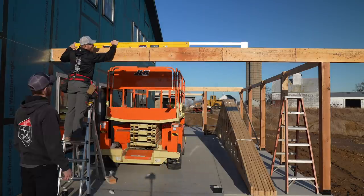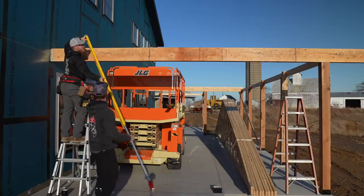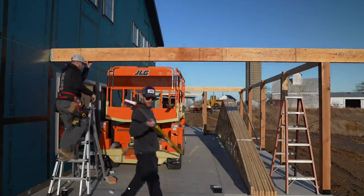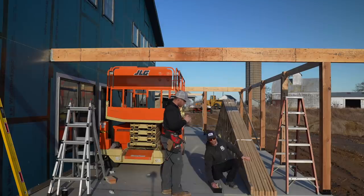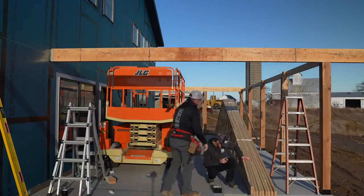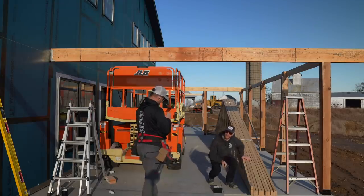Reading 0.05 — see, I'm not even lifting that end up over there. That's where the water slopes off the roof. Well, we crowned this so there's actually a little bit of a crown there. It should be zero, so we should be at six and a half. That's what we are — let's go. Both headers are done and those headers are going to support the main truss system throughout the middle with the raised bottom chord.